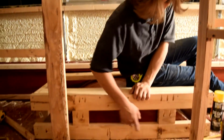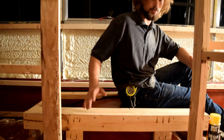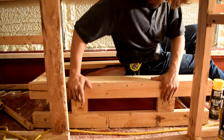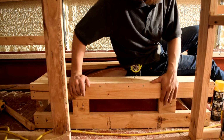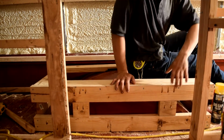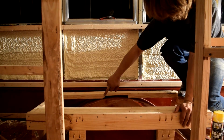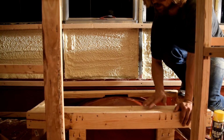So what we did is ran a square around the box on 3 sides, and then from there I added short little 2x4s, 4 blocks. I added 2 on each side and then put another round again on top of it around all 3 sides. On the top, to make it flush, I added the 2x4 across. It is on this rounded portion, so I had to cut out a square for the wheel well to sink up into the 2x4 to make sure that it stayed flush.